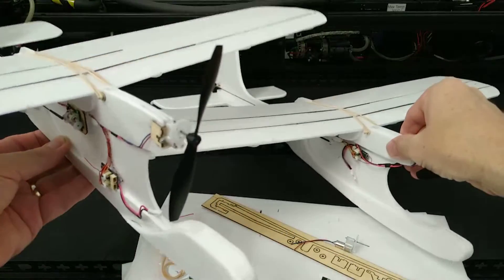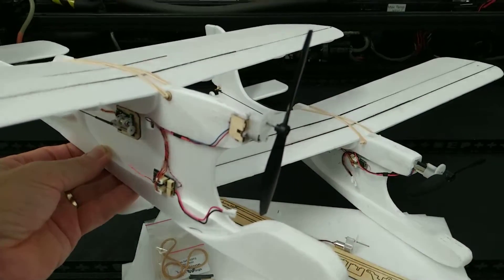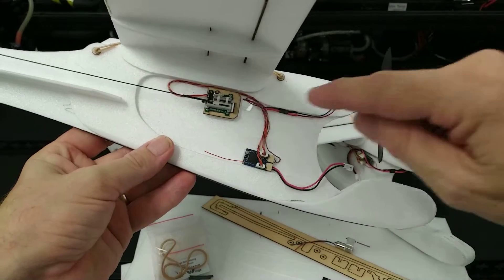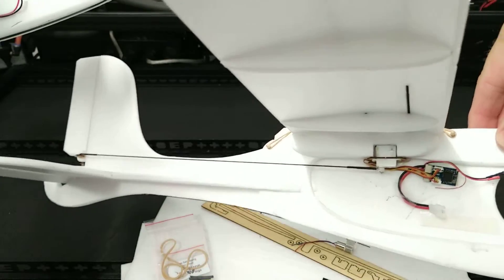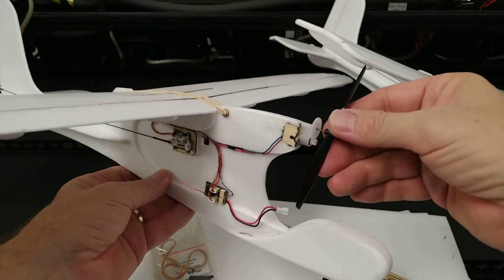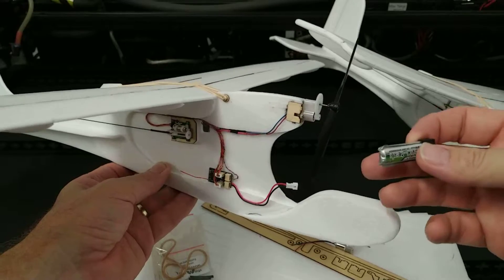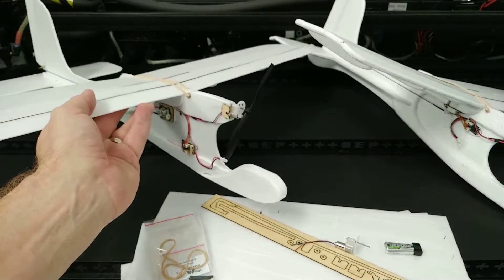Comparing the two: with the light version we've got a 7mm gear drive, whereas on the standard version we've got an 8mm. This one being a bit lighter, we can use a 7mm gear drive, and we're also utilizing linear servos as opposed to the 5320 servos on the standard version. With all these modifications it makes the whole airframe lighter and we can therefore use a smaller battery as well. This all adds up to give a very lightweight aircraft — it's quite a floater.